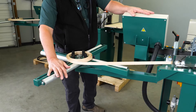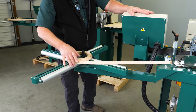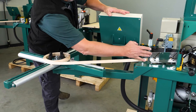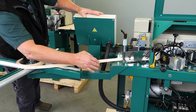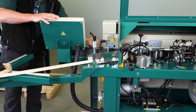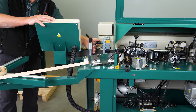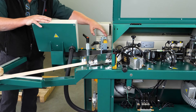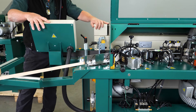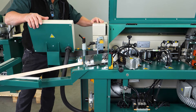On the back side of our G0854, we start with our carousel which hosts our edge banding tape. From there we have the in-feed fence for our edge banding tape that feeds the initial part of our system. There is an adjustable handle for the in-feed fence, a locking handle for our panel feeder, and the intrinsic safety switch for our panel feeder. When our panel feeder is in the open position the machine will not run — it shuts all systems down.